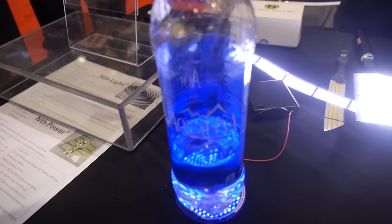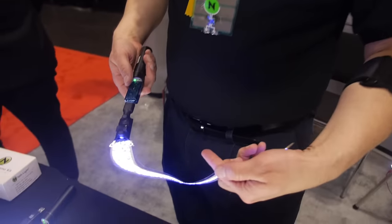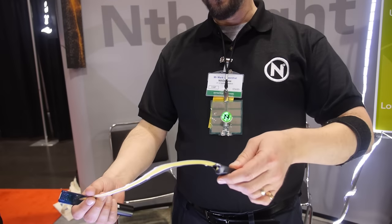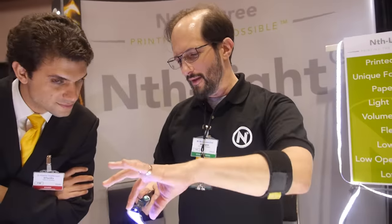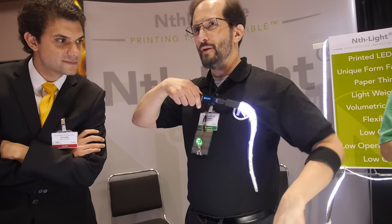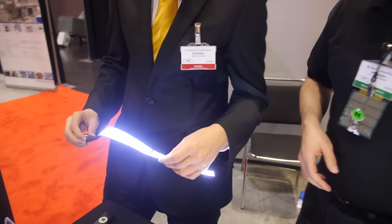Those are a standard mini LED. We actually have a dedicated fab — they're highly aligned with our wafer supplier, so if we can do high volume, they can process a thousand wafers. This has phosphor only on one side, so this is actually the backside lamp. This is a translucent lamp — if the phosphor wasn't on, you should be able to see right through it. This is actually printed with transparent conductor on both sides. We've used this technology in wearable fashion — there was a fashion show, and the designer had us make lamps with various shapes, then stitched them inside wedding dresses and wired them up to a power supply, making these flashing, glowing wedding dresses. It's very lightweight and very flexible.